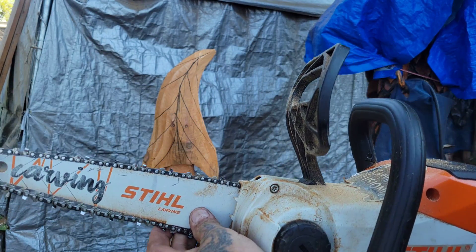This sander I have here is a ready rod. These nuts screw onto it — there's a locking nut, a washer, then another locking nut under there with another washer. It's just quarter-inch ready rod, or whatever fits in your drill, and this is a grinder handle. I had to hollow it out with my Dremel so it fit in there. I use this because if you don't have this part, when you're sanding, this emery cloth — strong sandpaper — can hit your knuckles when it's spinning. Trust me, you'll get knuckled and have big scabs on your knuckle.